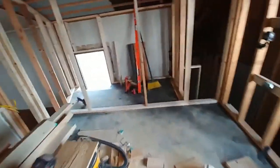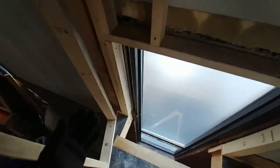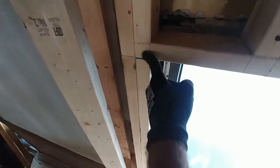So you notice this back wall isn't framed at all, which I realized we're going to have to do. Rather than starting over there where it kind of began, I started fresh over here and realized quickly that essentially, if I were framing this wall up anyway, I would make a regular window opening with what you would call a header and a jack and a king, and that would be planar with what is basically the rough opening for these windows here, so that's that.